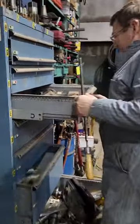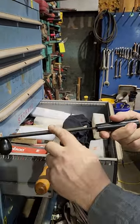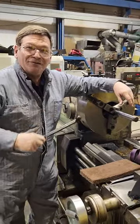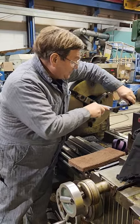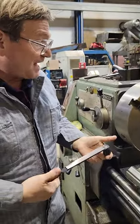My secret weapon — not too many shops have these. I wanted some of these many years ago but they were just too expensive and no one would buy them. It is a carbide tooth file. They don't make them as big as regular files, but it's amazing. I actually used this a couple years back when we had a defect on the road in one of our trucks — part of the bearing had welded to the spindle, and we filed the bearing down so we could put new bearings on. It does two things: it's very aggressive on standard steel, and it will also file hard material.